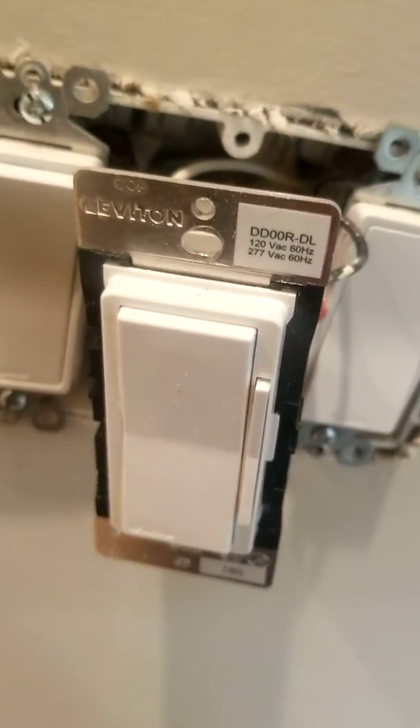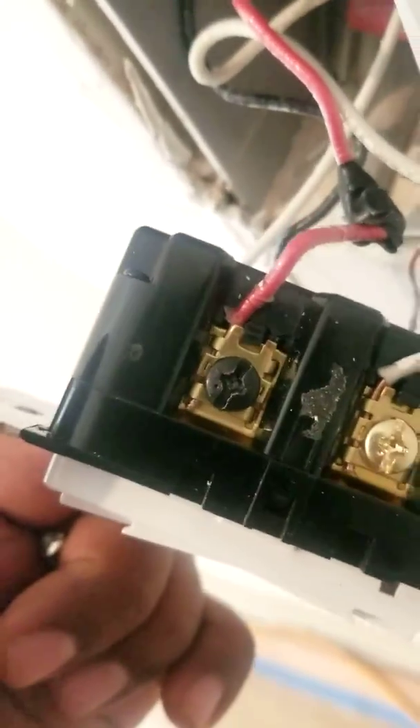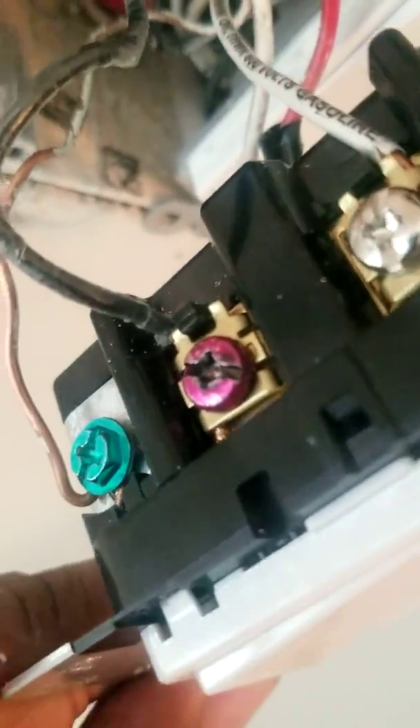It's crucial — and I'm repeating this: the remote is at the line-in box, the main switch is at the load box. The second traveler wire has to come in on the BK wire, because all these boxes have to have power at the BK. That's how the power connects. This BK terminal is always powered on — that's the communication terminal. The red RD only sends power based on the command: if I press down it turns it off.